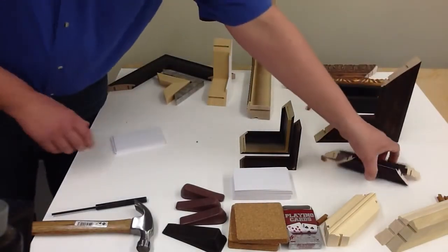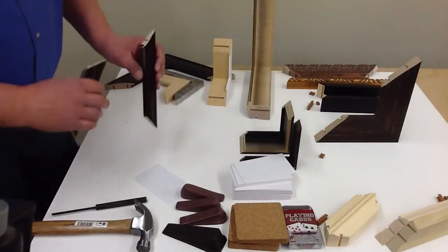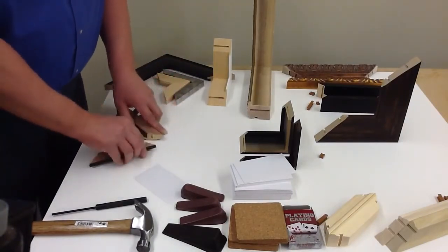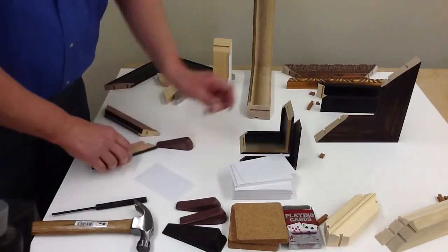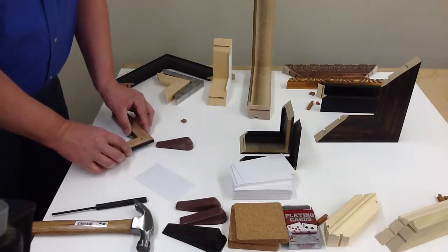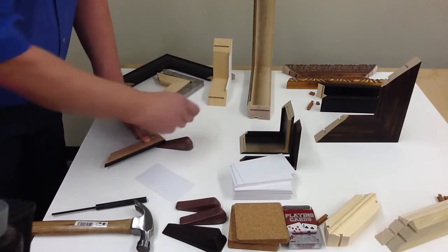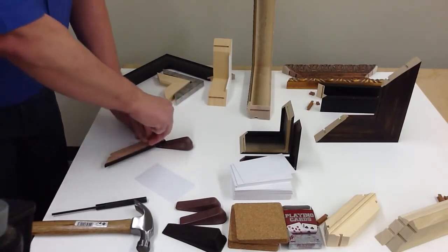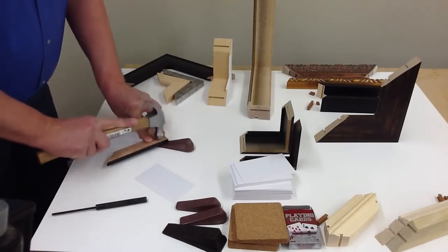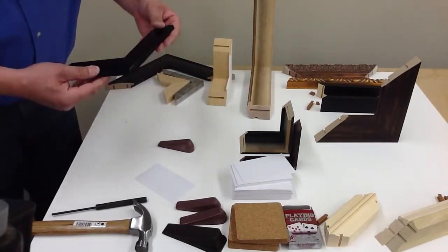The other one I have here is this molding. Like I said before, it's the opposite. It's high towards the artwork, drops down towards the outside. Here you can take your rubber doorstop, apply some glue, slide the parts together, simply slide it onto the stop, and that holds it in place, and you set your key. And here's your joint, perfectly tied together.